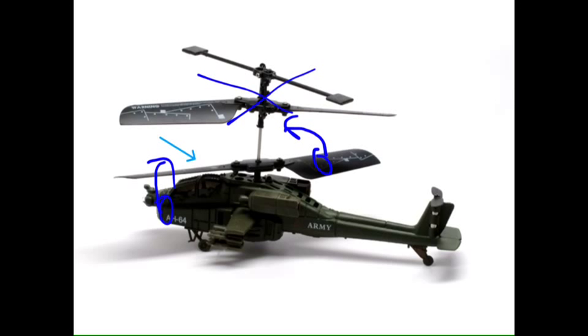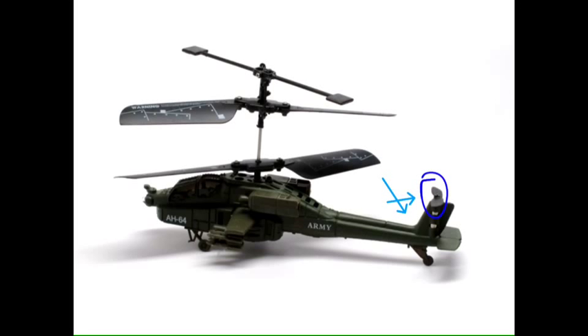And that's not very good. So what they do on regular helicopters is they put a tail rotor on the back — usually in this area, but not this rotor; it would be something different. This tail rotor counteracts the torque of the main rotor.